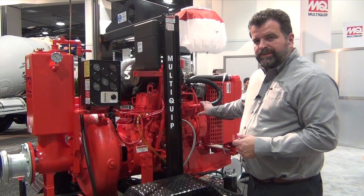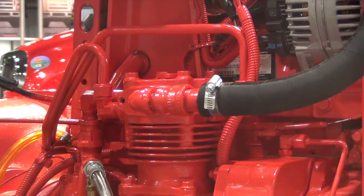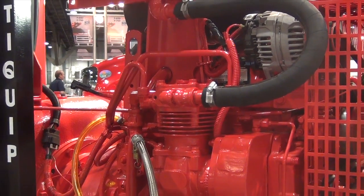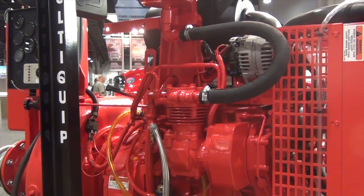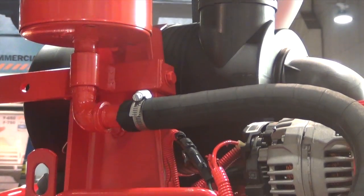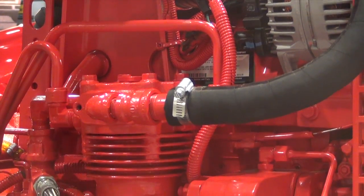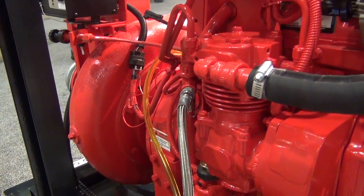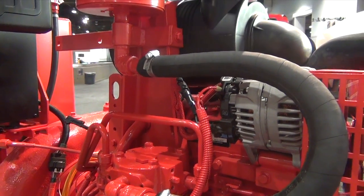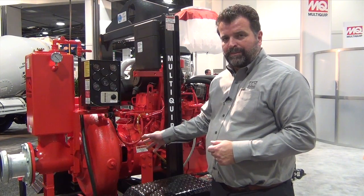Let's talk about the priming system. Over here you see the compressor, which is a part of the engine in this case. This is a single-cylinder compressor which, along with the Venturi system, evacuates the air from the pump housing — that is the active priming system at work. As part of the ActivePrime system, when it's evacuating the air, you never have to worry about fluid, contaminated water, sewage, or anything ever being purged from the pump into the environment. That's what really makes this pump have an EarthSmart priming system.